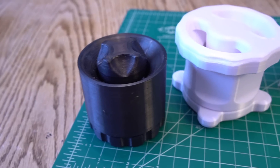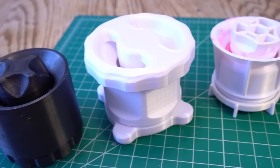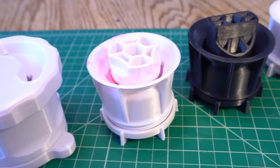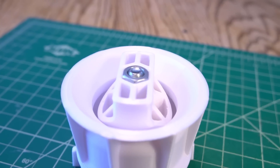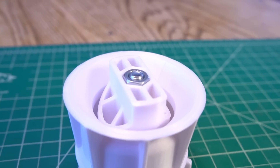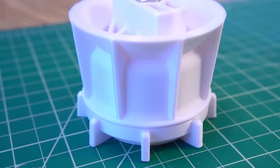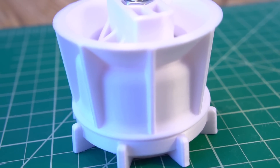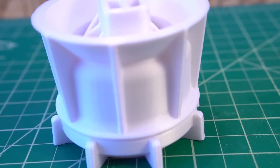I've been working on this set of 3D printable molds and printable wheel cores to try to tackle the puzzle of how we can cast proper urethane skateboard wheels at home. I cast my first wheel a few months ago with an early version of the system, and the kit has undergone a lot of development since then. I replaced the 3D printed threaded section with a nut and bolt, redesigned the whole system to print with much less material, and added flanges and knurling for strength and a more positive grip when assembling and disassembling the mold.